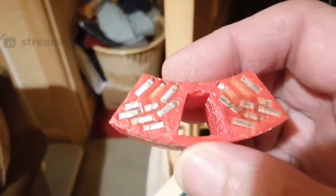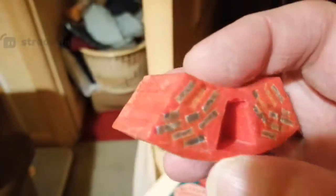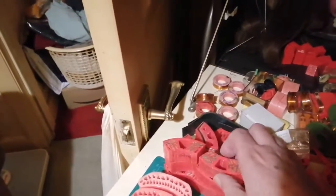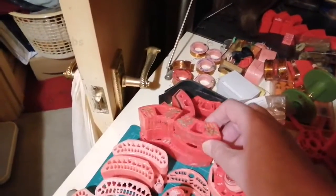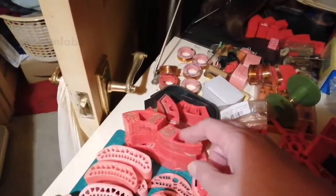So the original segments, I'll just give you a quick update. The original segments, which I did when I first started this thing, were using steel shims, angled like that, 25mm long by 8mm by 2mm thick. These were the original ones that I did when I first started this anti-drag generator. Interestingly, these performed in such a way that when I loaded it down, it didn't slow down. But then the steel itself was causing a significant amount of drag.